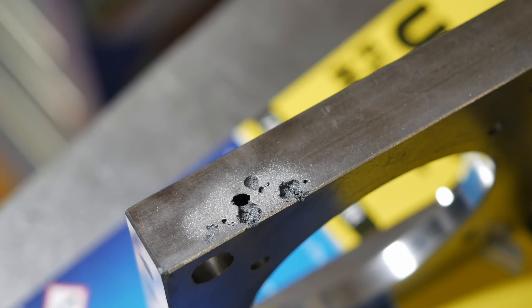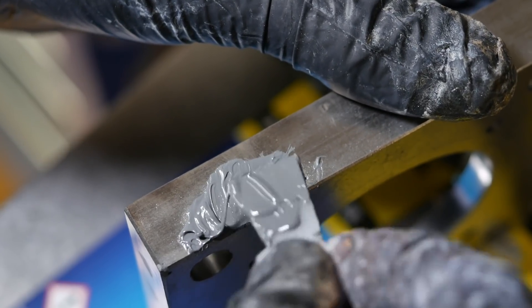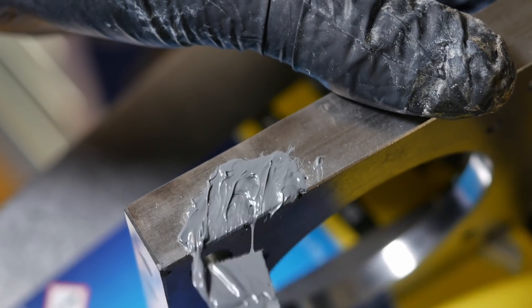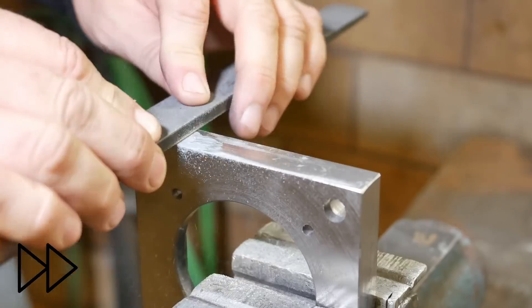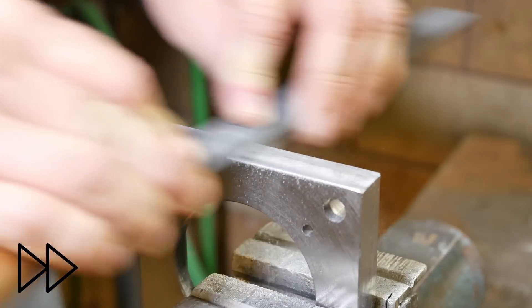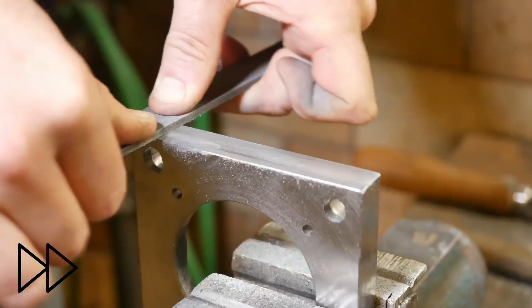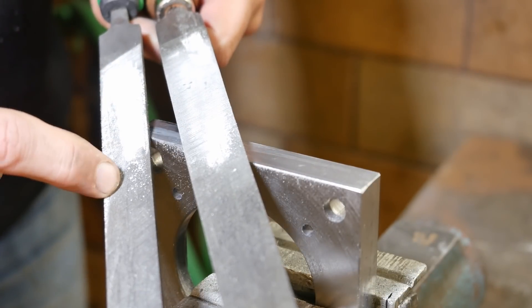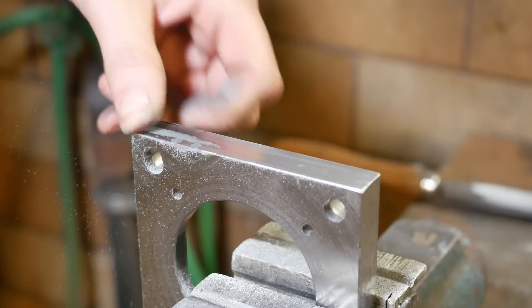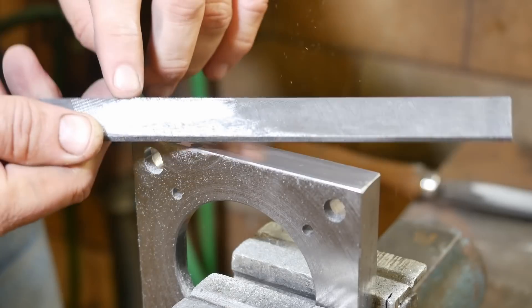Last defects came to light while machining, so let's bog them up as well. Since I've done the final machining, I'll bog these and then just hit them with a file to bring them down to size. I've switched now from a double cut to a single cut file. Single cut files when draw filing make a much nicer surface finish, as long as you don't get anything stuck in the teeth — that's why I put chalk on it.